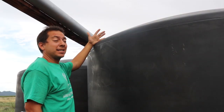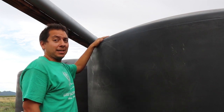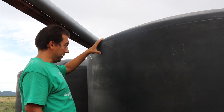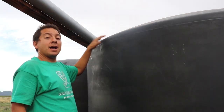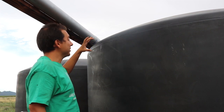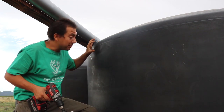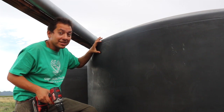With my last project I drained a bunch of water and put it in the IBC tote for clothes washing — that's 250 gallons. That should give me enough clearance to drill in here and put in the overflow pipe without a bunch of water gushing out at me. I'm going to use the same four-inch hole saw that I used to cut the holes in the front. Three-inch pipe is going to go in — you'll see what I mean in a minute. Wish me luck, because if the plastic piece falls inside the tank, there's no way I'm fishing that out.